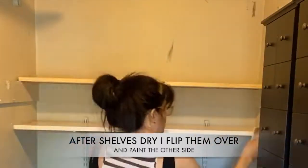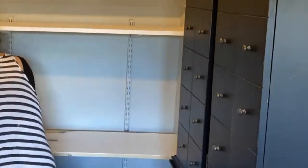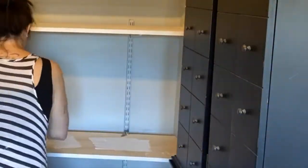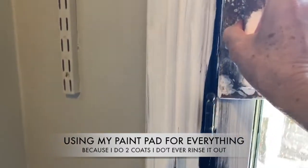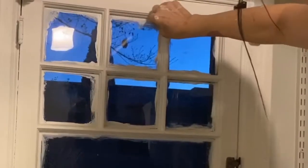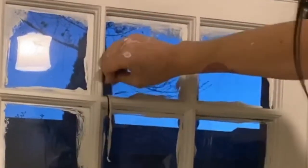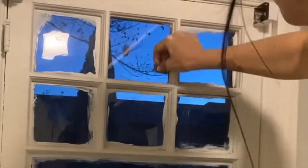I bought three eight-foot shelves and had Home Depot cut them in half — they do it for free. So it only cost me $30 for all these shelves. One of my little tricks: whether I'm going to end up with a glossy or flat finish, I always start with flat paint. It's thicker and doesn't get gooey and rubbery. When I'm finished with the flat, I use Diamond Finish Varathane over the top and you get a beautiful finish. And if you're going to do any distressing, you can't distress or sand a semi-gloss paint.